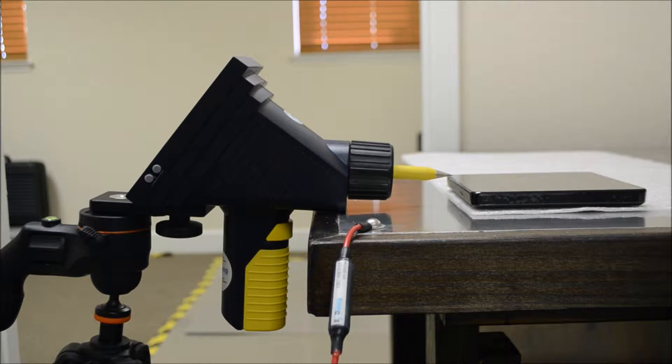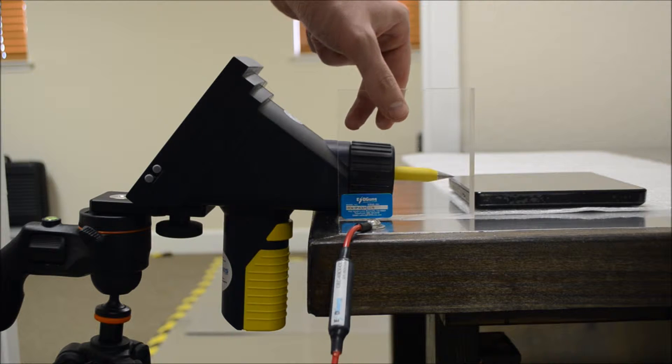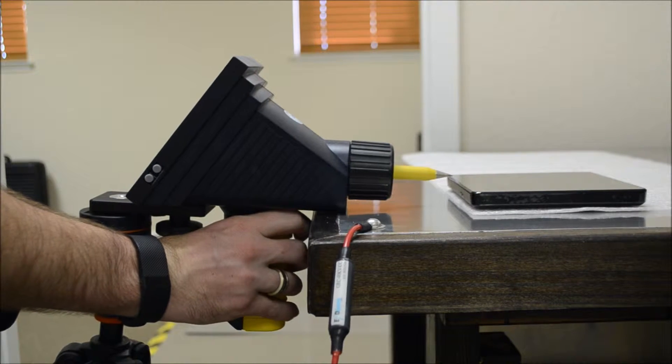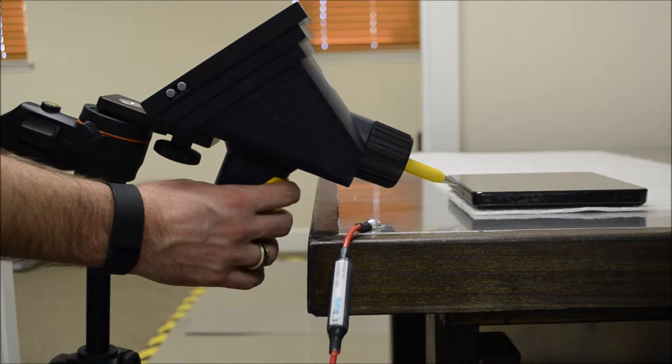Here is the NSG-435 mounted on a tripod as promised. As we place a 10-centimeter spacer between the DUT and the edge of the coupling plane, you'll see what kind of clearance we have with a small electronic device. The tripod mount gives us clearance from the tripod as well as the table's edge.